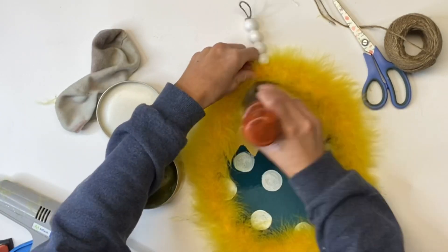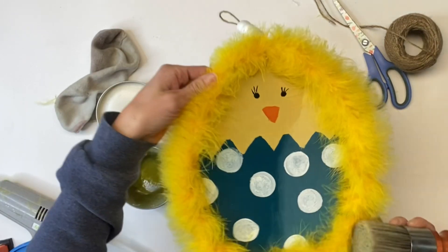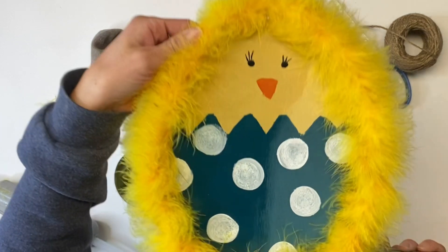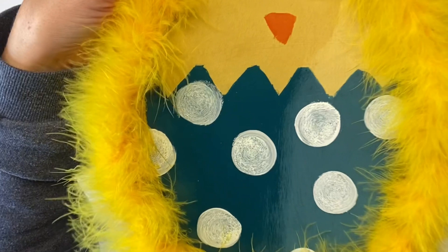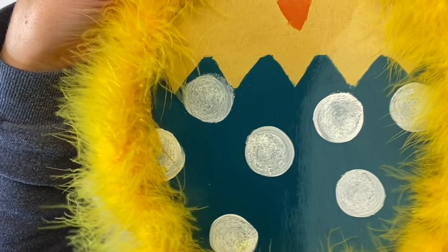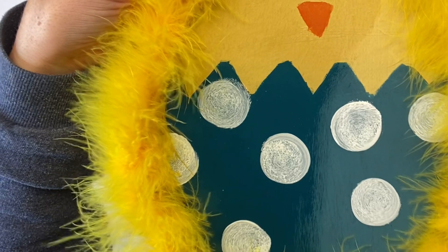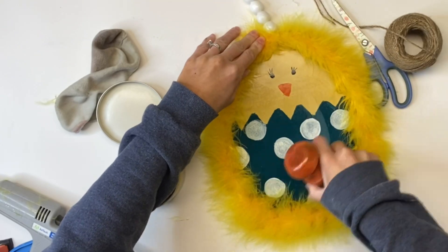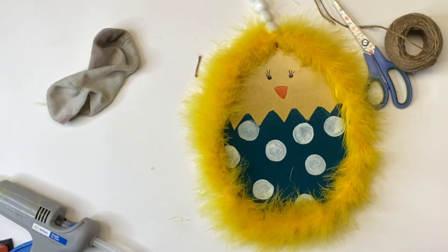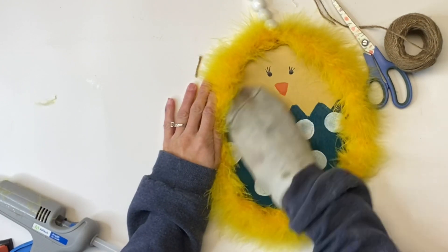To finish this off, I'm just going to give it a top coat of the Wise Owl Furniture Salve. As you can see, I applied some of the salve to the left side and the right side I still have to apply. You can see how it really brightens the paint and gives it a finished look. I apply this using my two-inch palm brush, and then I just take a cotton sock and rub it in.